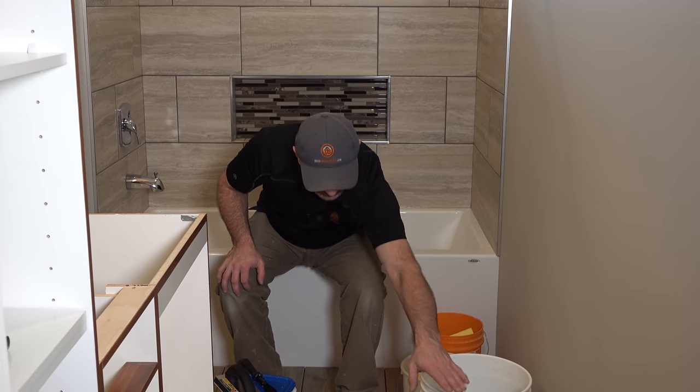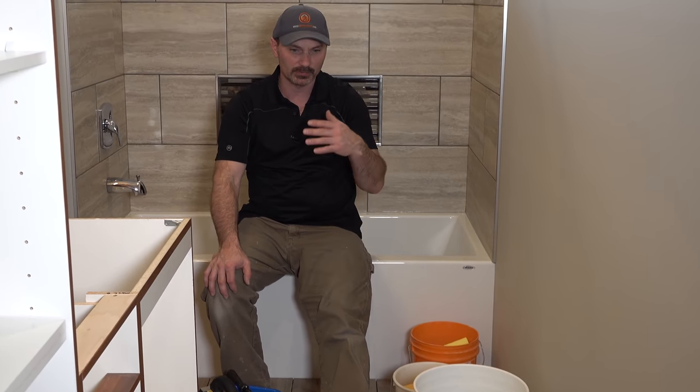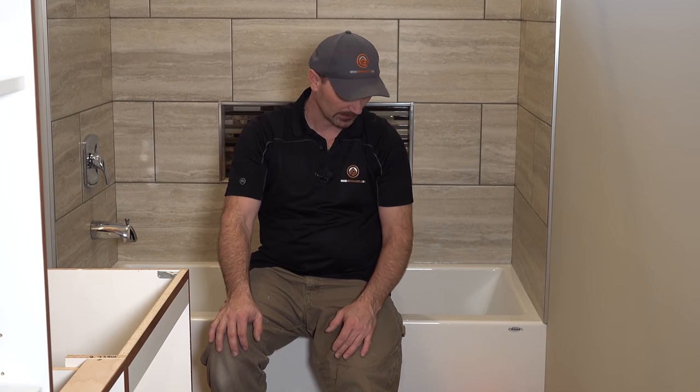Something I should mention: the old water you have to discard — don't dump it in your toilet or down the drain. Depending on your type of grout, the sediment can build up in the pipes and cause issues. Or if you're using the type of grout we're using, the glues in the grout can leave a ring on your toilet if you don't clean it right away. So just take it outside and dump it in the flower bed or whatever.